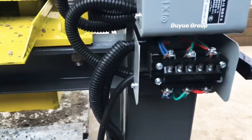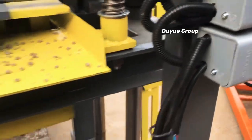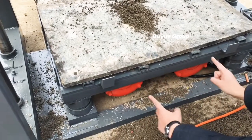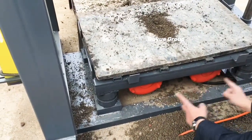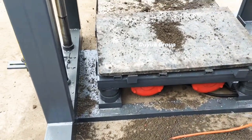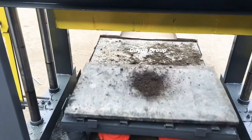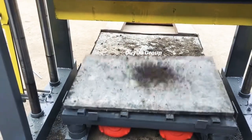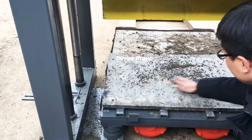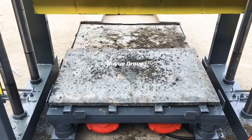I hope you can understand. After this kind of adjustment, the two vibrators will be rolling in opposite directions. Both directions are fine and good. You can test it again with material — now you can see all of the material will spread everywhere. That means the vibration force is very fine.